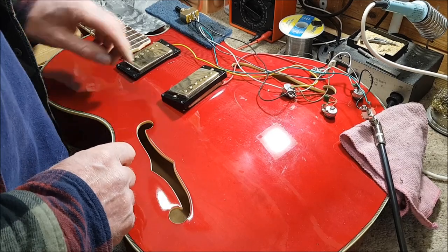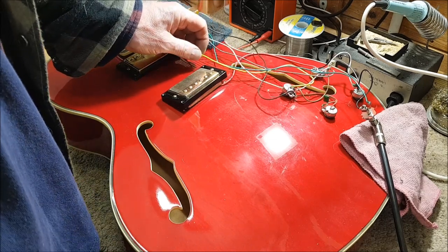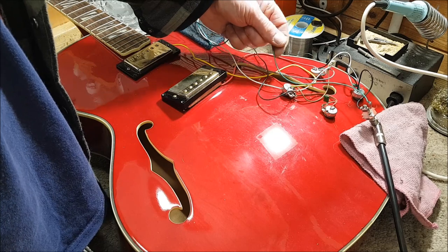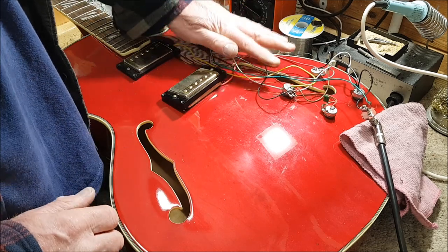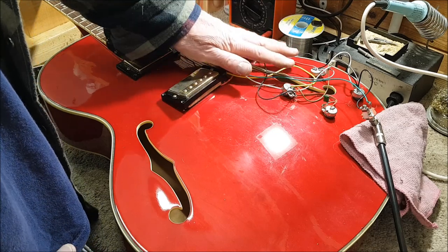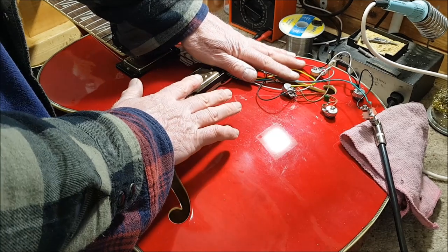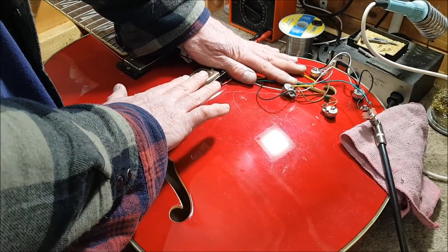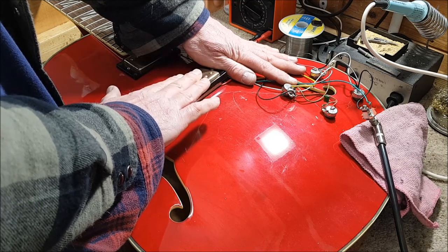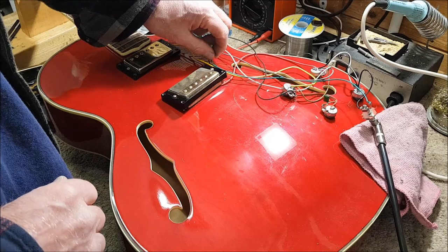You can see that none of it is really shielded. The only shielded wires on this instrument are the actual pickups. The rest of it is unshielded wire, so when you go near it, or if you are holding the guitar next to your body, you're going to have that effect. This is why sometimes when you hold the guitar and touch something earthed, like the strings, the noise diminishes. So there's absolutely no shielding and no attempt at any shielding in this guitar at all.